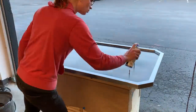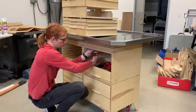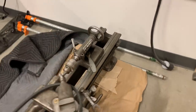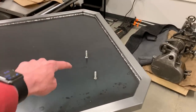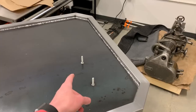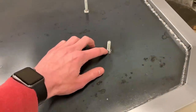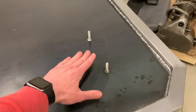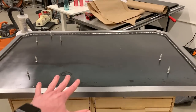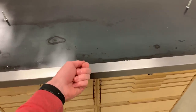I sanded and cleaned everything up and now I'm going to give it a coat of clear paint — I want to maintain the look of just raw materials for this. Here I'm bolting it down to the cabinets. The feet on this lathe are relatively small, so I'm going to put a plate on here that will spread that weight out over a slightly wider area. Also, since these welds are on the top side, if I tried to put the lathe directly on here it would be sitting on those welds, so this way I can drill big holes in the plate that I put under the foot to raise the lathe above these welds. It will also raise the lathe a little bit higher off the pan, giving me a little more clearance when turning the cranks so my knuckles won't be hitting this.